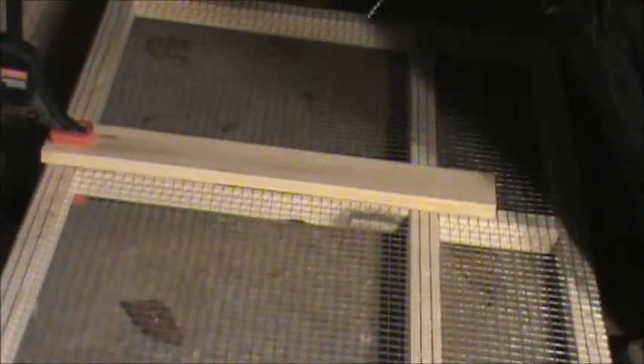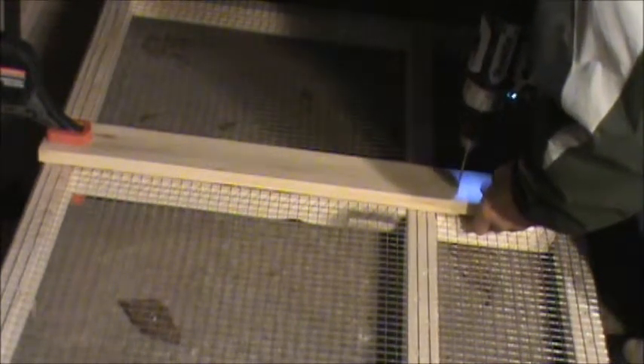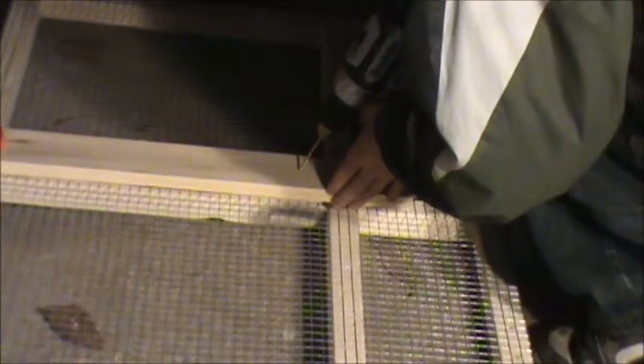Because I'm building this out of pine, you've got to pre-drill pretty much everything. I'm using two and a half inch screws to hold it all in place. Just like I told you guys in the previous video, I didn't screw that center board in because you have to use a pocket screw. I'll make sure there's one at the front, one directly behind it, and then one at the very end, to make sure that this thing is secured tightly.